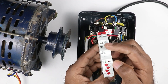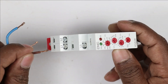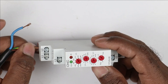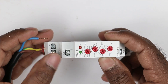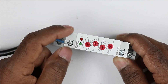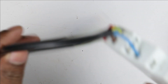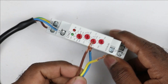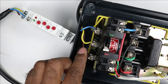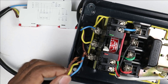First, at these three terminals I am connecting all three wires. Take this red wire and connect it with the L1 terminal. At L2 terminal, I am connecting the yellow wire, and with L3 terminal, I am connecting the blue wire. To provide three-phase incoming power supply to this relay, I have connected these three wires. Now the other ends of these wires we have to connect with the starter — with the same incoming supply terminals connected earlier.